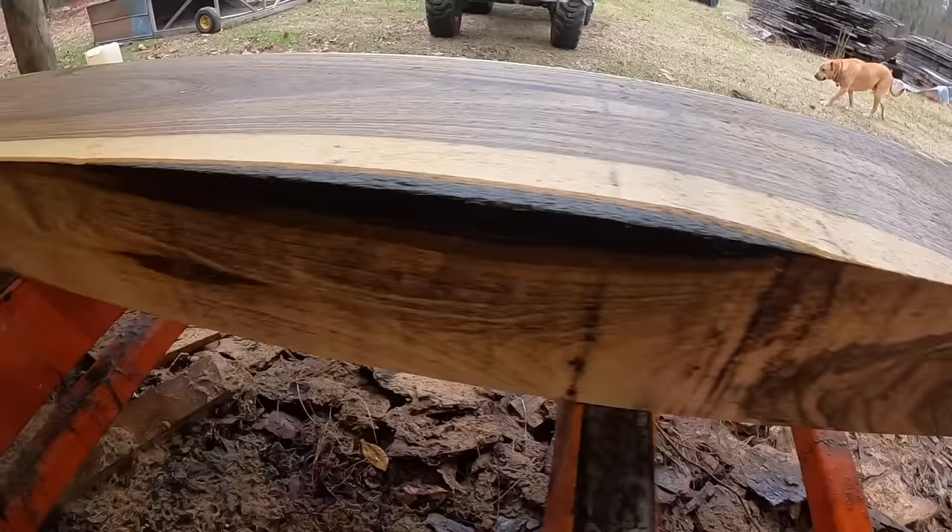I think it's time to stop messing with this one. I've gotten most of the sapwood off — there's some there and some there — and it ended up being about five by nine, which is still a pretty substantial chunk of wood. It's a far cry from eight by twelve, but it's substantial especially for a mantel piece. Look at that wavy grain right there — that is really pretty stuff. If it was my mantel, I would have this as the front since you've got the most heartwood with very little sapwood, this as maybe the top, and the back where there's still sapwood remaining. He was understanding that I couldn't get eight by twelve. He was totally fine with the picture I texted him. I told y'all there was a square log in that crooked thing somewhere — we just had to get it out. Thanks for watching and I'll see y'all on the next one.